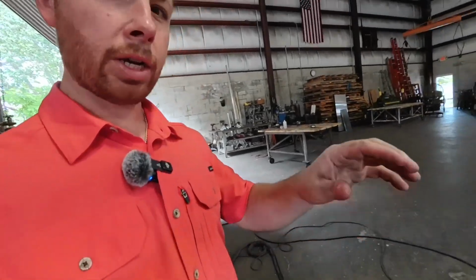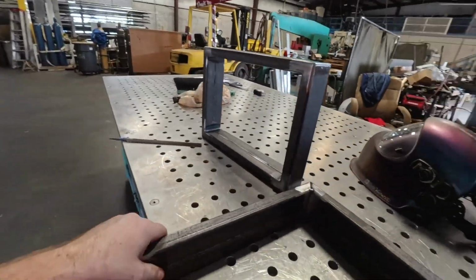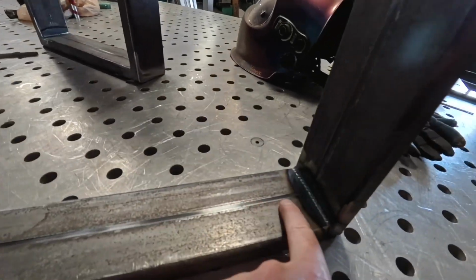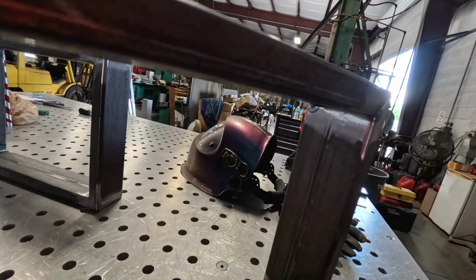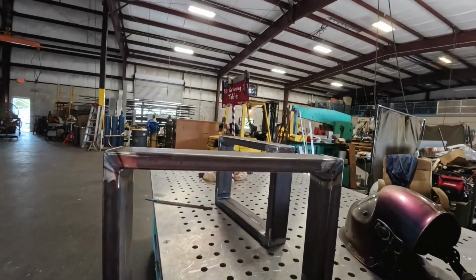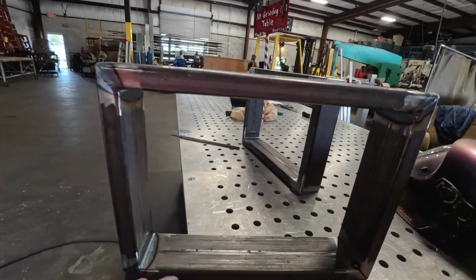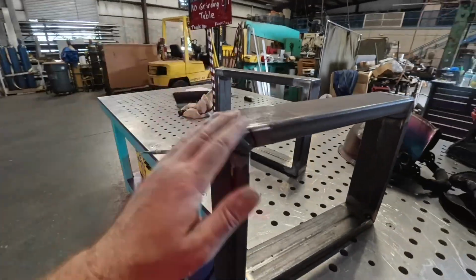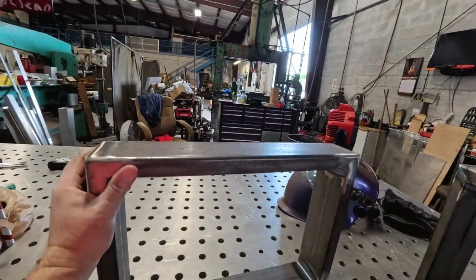And there's a couple other little tips I could show you, if you're interested. I make a box like this, and because this is seamed tubing, square or rectangle tubing, I make sure all the seam lines are going the same way, because you could mix match them and one would be right here and then one over here. It depends on what type of tubing you got. That's just another little tip to make it look better, because these seams are hard to get off. Even if you sand it, it takes a lot of sanding or grinding, and paint doesn't really cover that up. Powder coat might, but paint doesn't. Little details like that make it look a little better, and we're pretty good.